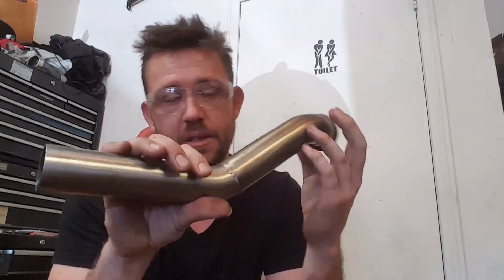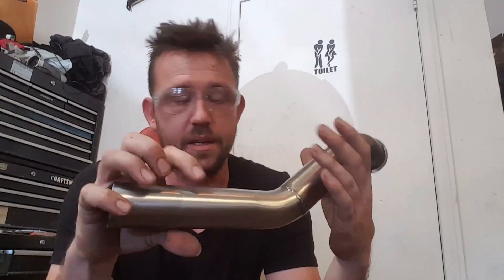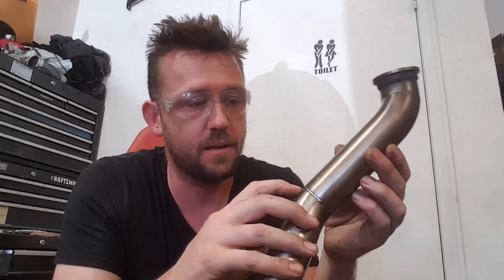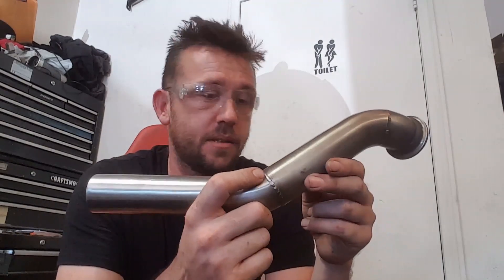That's why we don't have the fancy camera setup and typical production value going on right now. But this piece that I've got — it's a wastegate dump tube — as I pulled it off the car today, I have to rebuild it because we found a problem with it. We can examine it: we've got welds on it, there's filler on it mostly, and there are some spots in here that look like it was done autogenously — basically pedal pulls, no filler.